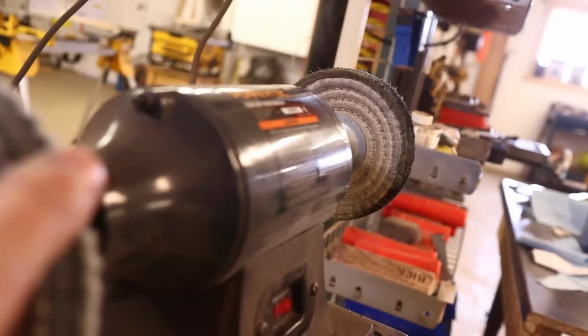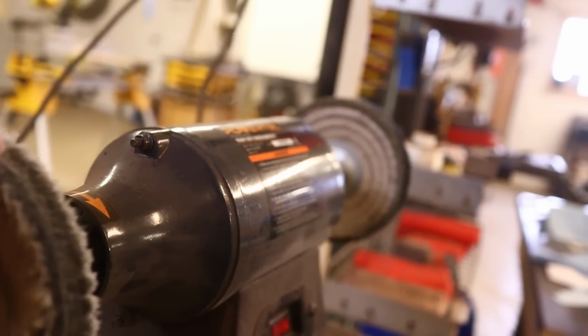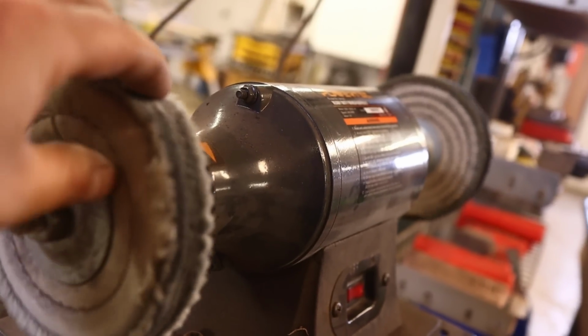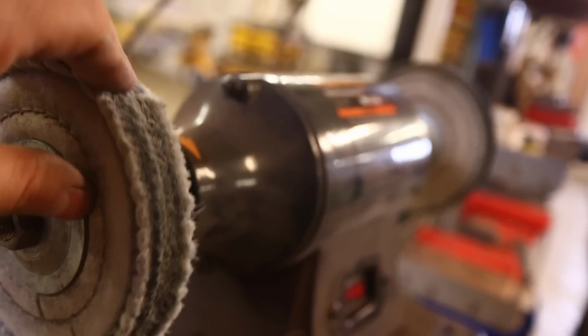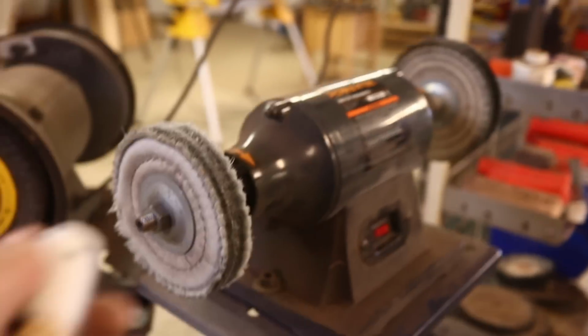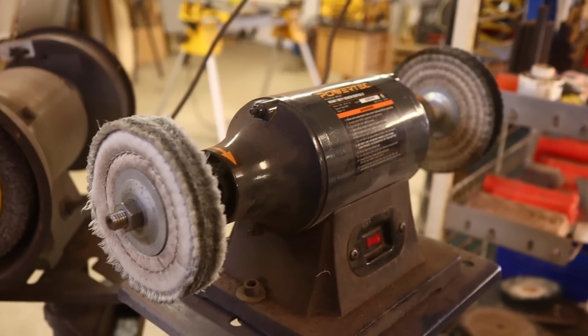This one here, you can pull the weave. Now I'm almost into a stitch here now, but this is a softer finish wheel. It opens up. Look at this. You can flap the wheel around. It's a softer finish, and so it's a little nicer for materials like this that you don't want to carve into or melt. This is a nicer choice.